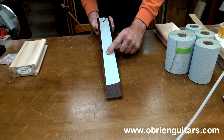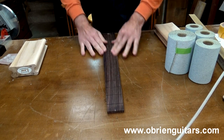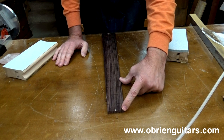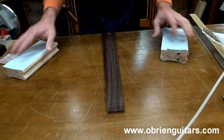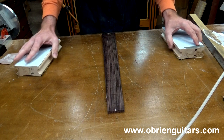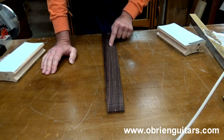I'm going to start by putting some double-stick tape on the back of my fretboard and attaching it to my bench so I can show you how to do this in the video. For the purposes of this video, I'm going to start with a 10-inch radius in this area, blend it into a 12-inch radius, and then finish with a 14-inch radius. I have my appropriate sanding blocks from LMI ready to go with 80-grit sticky-back paper on them.